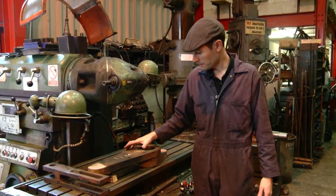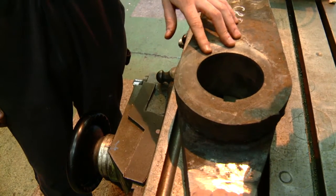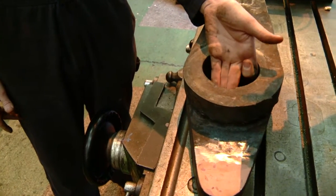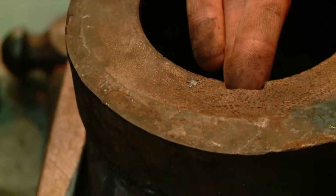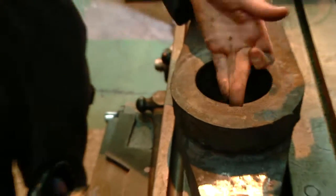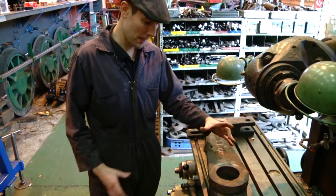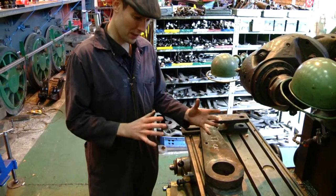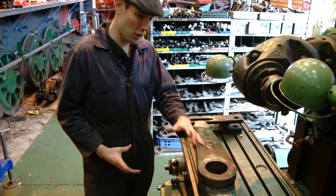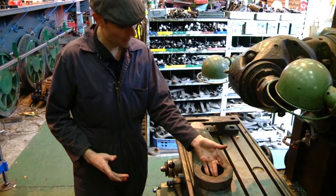One of the most important parts of this section of the locomotive is that the brake shaft is located onto this operating arm. For that function, we actually have a rectangular keyway here which matches up with the same on the brake shaft, and a pin is driven into it. That allows everything to lock together and ensures there's no movement, which can cause unnecessary wear.